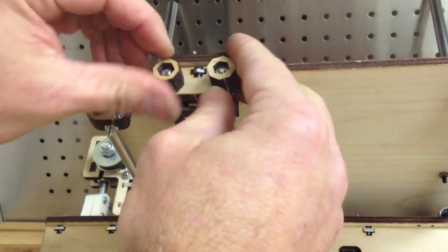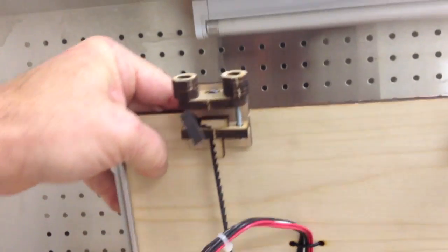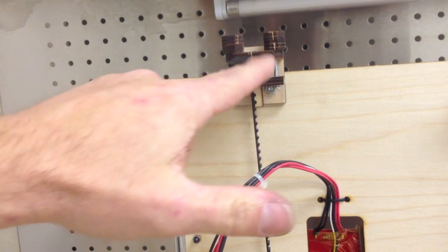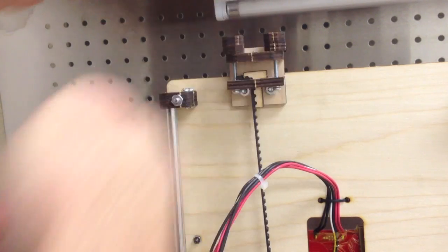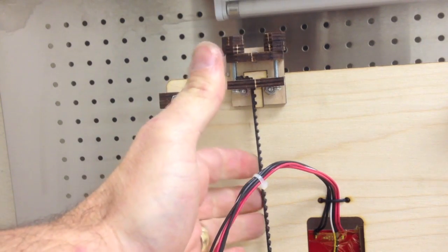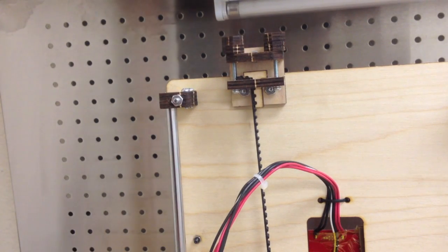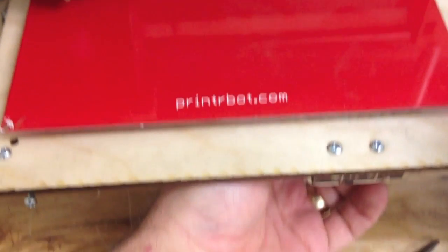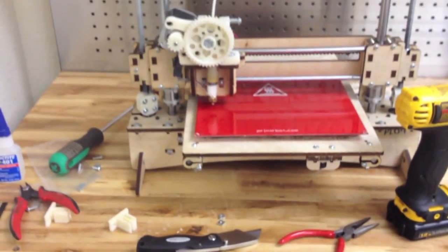Already it's working beautifully. You want to look at how parallel it is — I can see it's not quite parallel, so I want that to be parallel with this right here, and then I'll snip this off. There we have the belt tensioner with two thumb screws. It's at the back so it's nice and hidden. As your belt stretches, you'll be able to adjust that really easily with just your thumbs. And that belt is beautifully tight right now. There you have it — the new belt clips and belt tensioner.